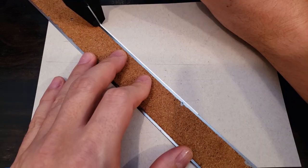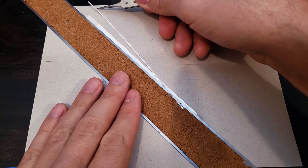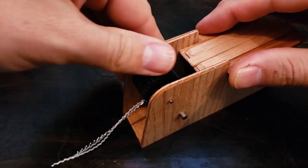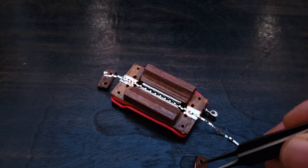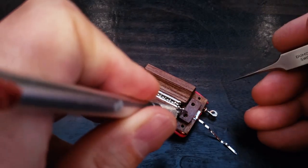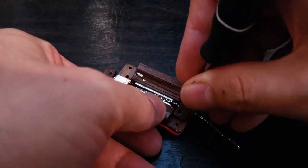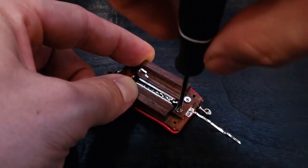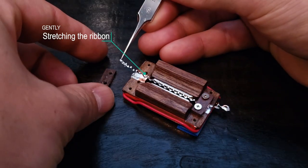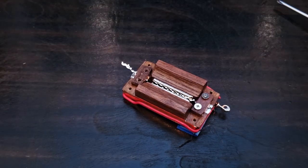Now I'll cut the ribbon and corrugate it with my crimper. When working with ribbons, you learn to breathe from the sides of your mouth. I adjust the ribbon so it's not touching the sides, and then I give it one last tension as I tighten the screws. With this mic, you're not trying to get really low frequency response — anything above 30 to 50 Hz is adequate.